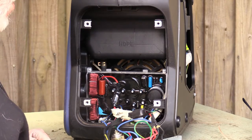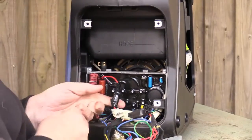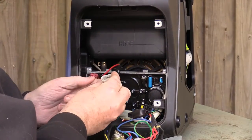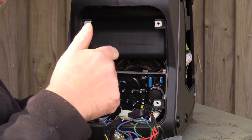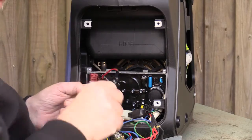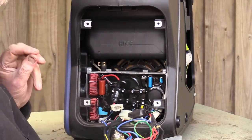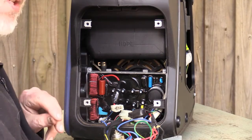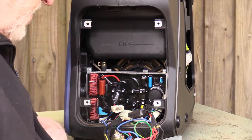As usual I brought my glasses but I forgot to bring a small screwdriver to pop these little plugs out. These little plugs have got pins with little finger bends on them — all you have to do is push that back and you can pull the plugs off, separate the leads, and work on them. You don't necessarily have to cut the leads, but I'll be back when I have it all apart.